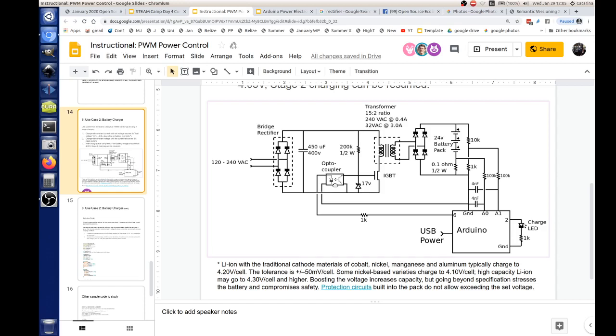Depending on the way you look at it, we're controlling the voltage across the batteries, but also we can control the current. And it's all based on our inputs over here. How do you control the current there? Well, by changing the voltage, you can only control the voltage, right? Yeah. You control the current by the voltage you apply. You look at the current across this resistor, the voltage, and you can calculate the current from that. You remember our voltage law, right?